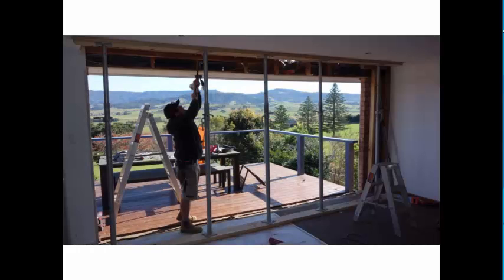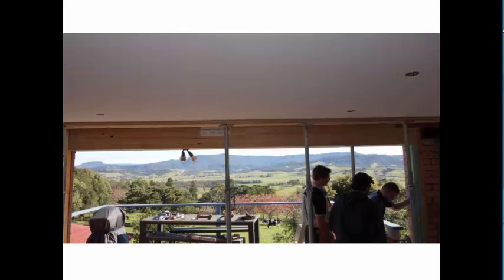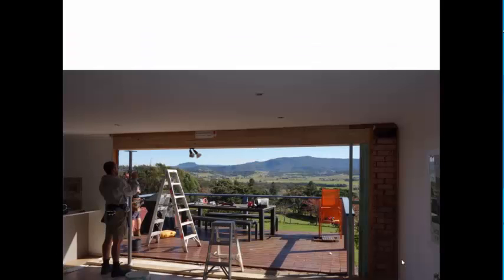See the photos of them completing it and taking it out. The actual beam that they used for this instance was a glulam one. They put it in, propped it up to get it in position, and just fitted it out with the stud walls to either side. On the right side, they've included it a bit bigger just to fit the 4.3 size in, and it's got the one stud on that side for the moment — suited to a 4.3 metre panel sliding door.